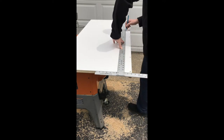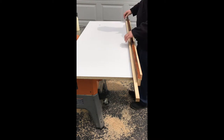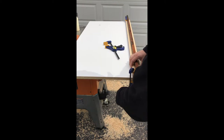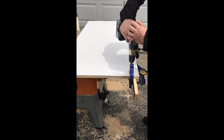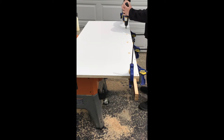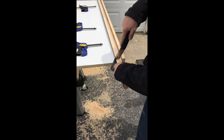From there I began adding glue. Once the glue was in place it was time for final assembly on the underside of the table. I put the spacers back in place, clamping them down and against the end piece of the fence to ensure good alignment. Once everything was clamped up, I flipped the piece over and countersunk holes following the line made earlier, then drove wood screws in to hold everything for final construction.